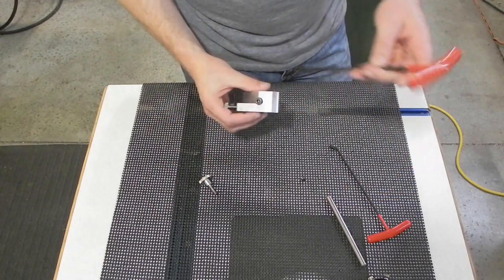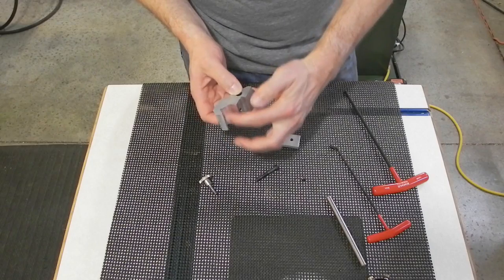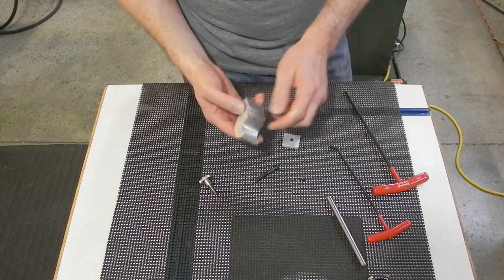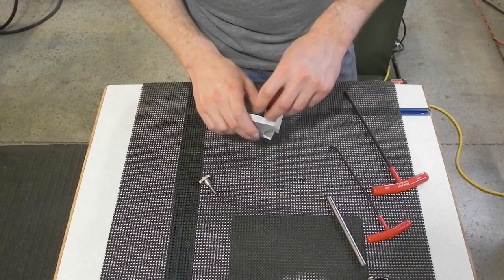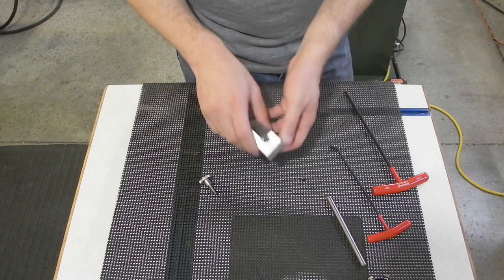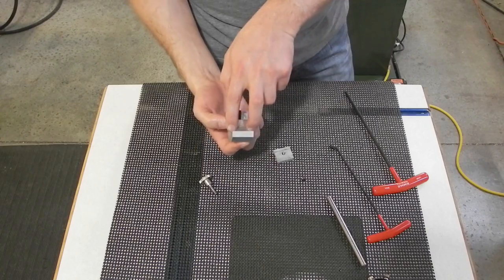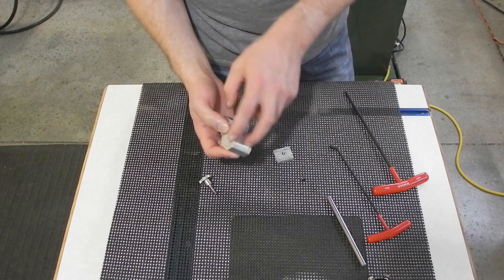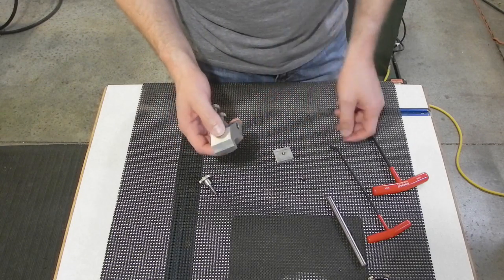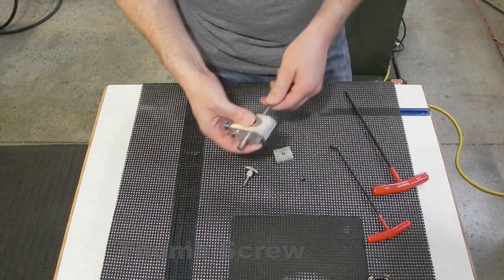And then the other thing I'm going to do is, let me take this off of here. Right here across the face that sits right across the front of the V-way, I'm going to put two rare earth magnets, because what happens right now is when you loosen the top larger locking socket head cap screw, the whole thing just wants to fall off the way because it's not a tight fit. So hopefully, I've done some checking, I think two rare earth magnets right here should hold it in place so that it won't fall off. You can tap it to adjust it forward or back if you need to. And then just this nut on the bottom should screw it down tight, so then it won't move, no matter how hard you hit the hard stop.